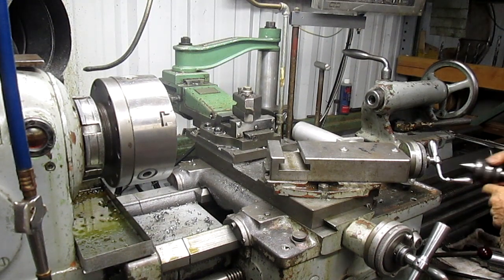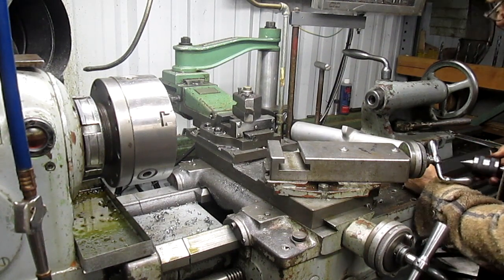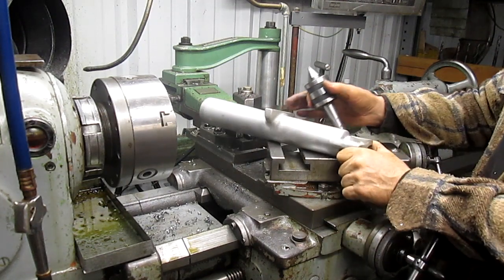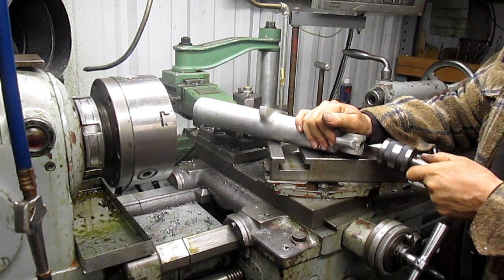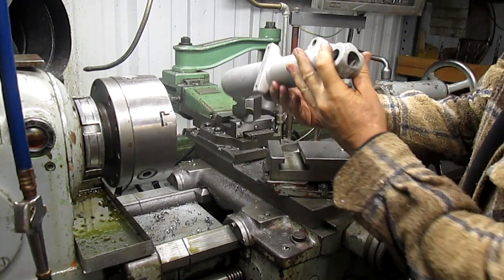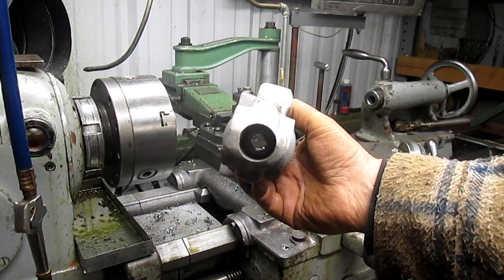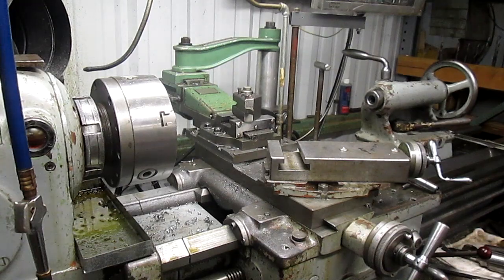We will put the live center in. Well, check that out. Because we've got a rotation there, the live center's not going to work. Can you see that? Let's get you in so you can see it. Boom. It moves all over the place. So either we bore this out and get an angle going on it, or maybe we bring the live center all the way in. Oh, in fact, can you see it? Let's look inside there. That is a notched hole. So that's dead in the water.